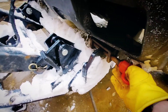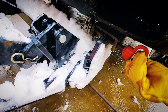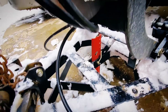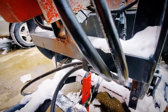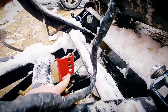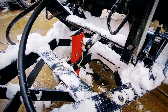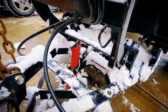As we start lifting this up, I only lift it until I can start to turn these — they're still pretty stiff. Turn it some more and now we can move this with absolutely no effort. That's how high we want to take it. The extra height also helps to clear the foot for the Unimount. Because we pushed down our lift ram all the way, we can adjust this so we can put our pin in for the top part of the mount here. I usually line this up with the middle hole — that gets the desired angle I'm looking for — and it goes in easy peasy. I don't have to hammer it or force it in. I just rest my back up against the moldboard and push on the mast, and it pretty much does it itself.